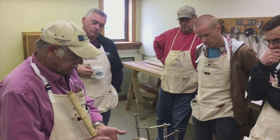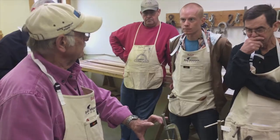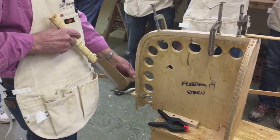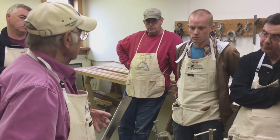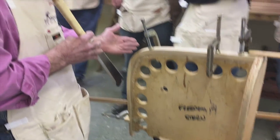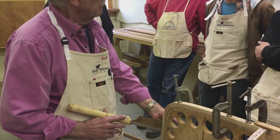The next step — if you take your time to cut this really accurately so that the end of the plank is cut perpendicular to the center line, we glued up the outside stem the same time we did the inside stem, so we know it should fit. But if you cut these sloppy, it means you've got to work that down with the plane. If you can make every cut accurate, you save all that fighting of that end grain. If you cut it just a little bit long, the saw gets held out that much and they get progressively longer. The problem gets worse and worse as you go. But if you start right, you save all that extra time and avoid possible bad fit.